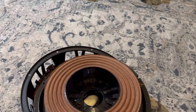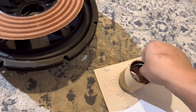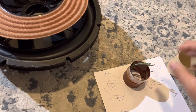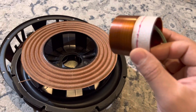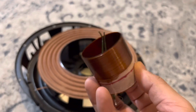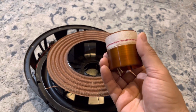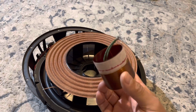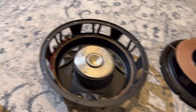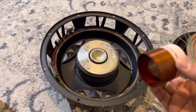Here is my replacement coil from Lower to Bass - they do a great job of packaging. I opted for a single 4-ohm flat wound coil. This is going to be able to handle a lot more current than the factory coil, so I'm going to hard-wire the subwoofer to only a 4-ohm impedance. It's a four-layer copper-wound aluminum on a Kapton former - really robust, a great fit for this. You can see it in the gap; once I align it, it's going to be a perfect fit.